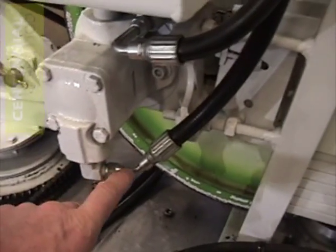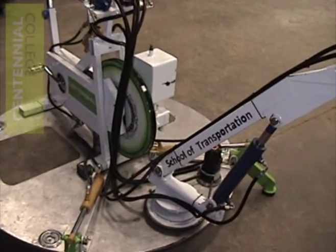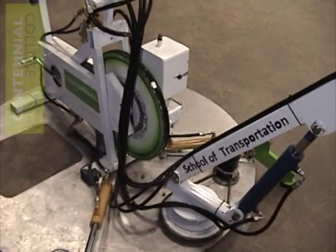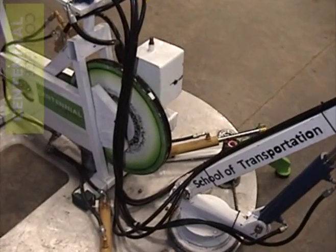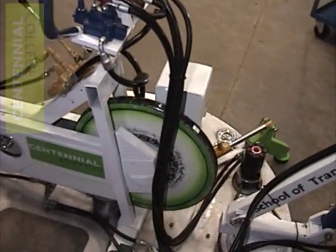From the pump, the oil comes up through this first hose and into the yellow control valve. The yellow control valve is for the outriggers that are mounted to the front of the machine. Earlier on in the project, we realized that the level of work being done using this machine warranted that the front of the device needed to come off the wheels and onto some sort of rigid legs.